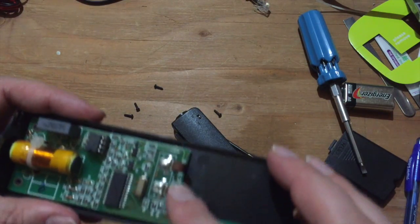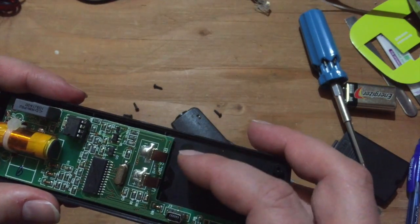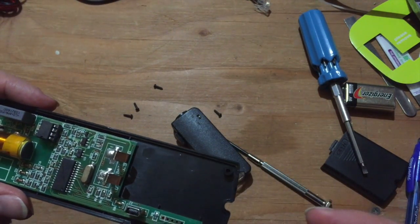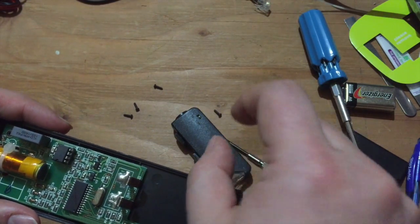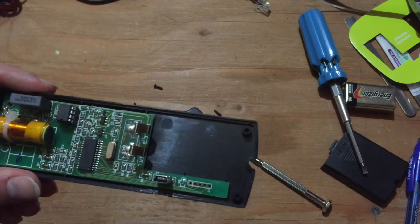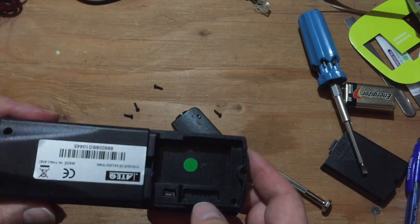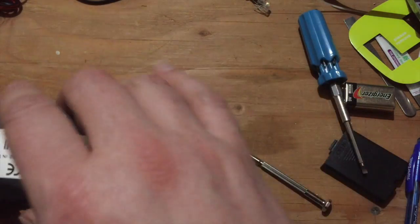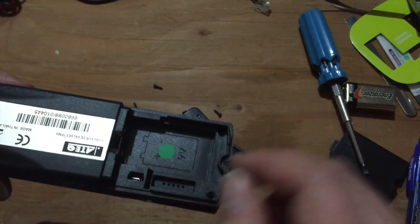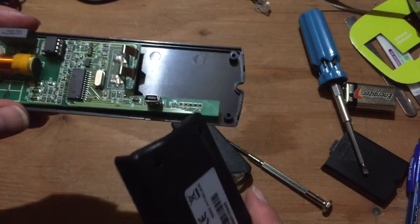I like that they're using these spring battery terminals for the nine-volt battery, rather than the wires that come out to the little clip that snaps onto the battery — those are always kind of annoying. This is really nice. And I like the way they've handled the case with the holes for the ICSP header, so you can have units manufactured complete and then program or reprogram them yourself if by the time manufacturing is done you've got new firmware. That's a nice little touch.